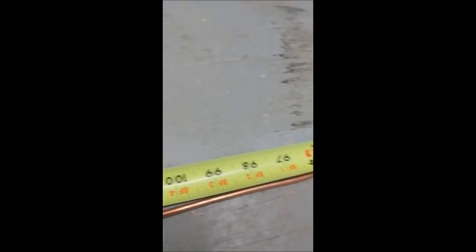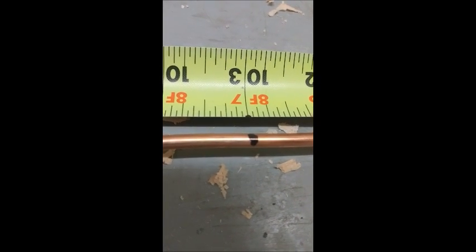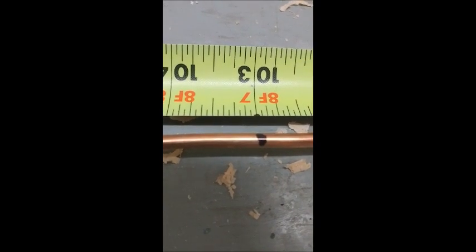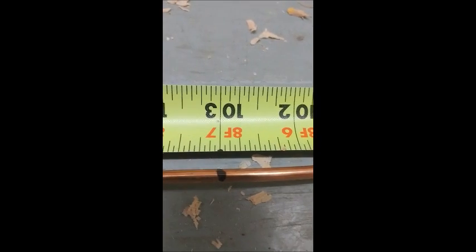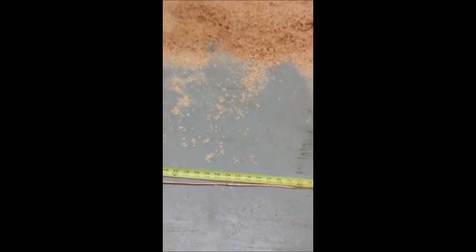I've got my copper wire laid out here. I don't think you've got to use number six — I think you can go as small as 12, and I think I saw one guy use number 14. But I just like how stiff this is; it was easy to get straight and it will hold its form pretty good in the conduit. So I chose to use number six, and I'm going to cut it at 103 inches. I may have to tune it a little bit — I know it won't need to be any longer than 103, but to tune it I may have to take it down to 102.